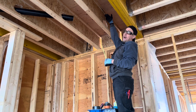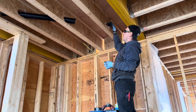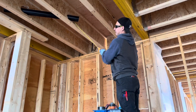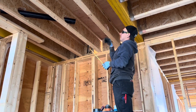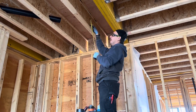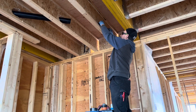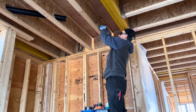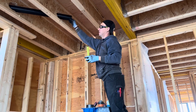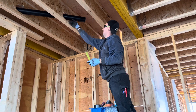I bring my line down here and put a cross. I usually take a level or a speed square and put my line here. My center line here is seven and a half, and this is two feet. So I go down a quarter inch per foot — we're grading. So I add a half an inch, putting me at eight inches for my horizontal line. Then from that center vertical line, I go three inches on either side so there's enough room for the pipe to actually squeeze through. That way it goes through the whole way and works out perfectly every time.